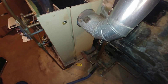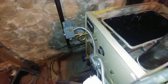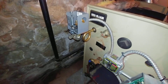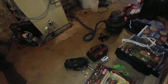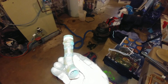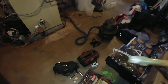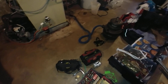So I shut it down immediately and went to check the pigtail, and the pigtail had been clogged — probably clogged from the beginning of its operation. I suspect that because somebody had ripped off and probably changed the relief valve, and when they installed another one, they did the compression fitting and put it on a T and so forth.